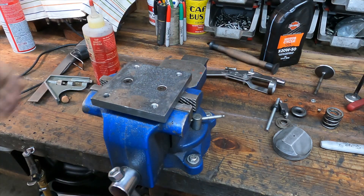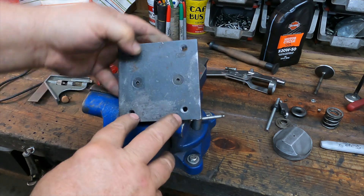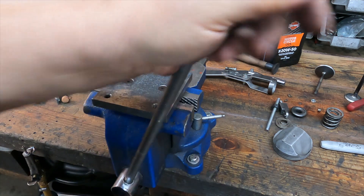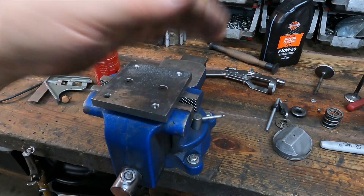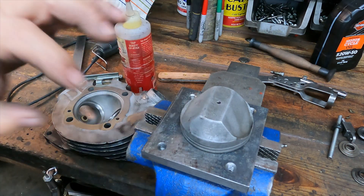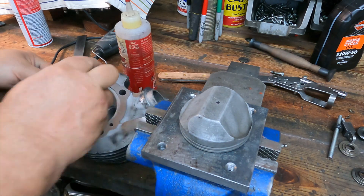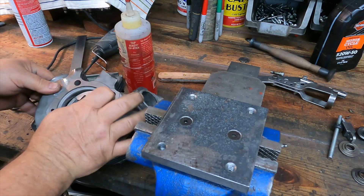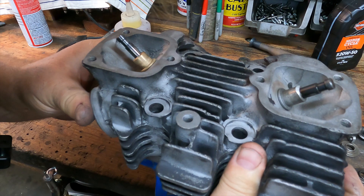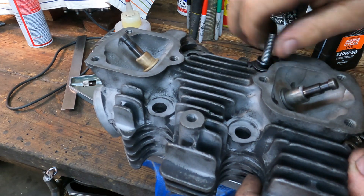Part two of that was I needed something to hold the heads. So I machined up a basic chunk of steel with four holes — two holes for 900cc heads and two holes for 1000cc heads. A little bar bolted on the bottom pinches in the vise, and I bolt my heads up on it. I also use a cutoff piston to keep the valves up in the head when installing springs and keepers — I used to use a ball of rags, but this works much better.